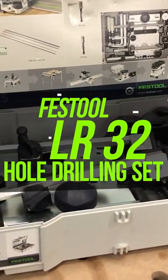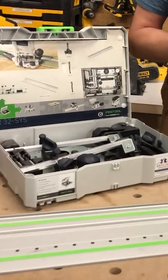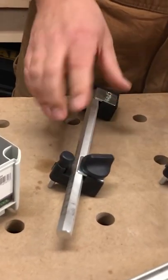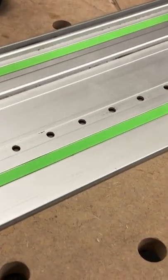This, if you're not familiar, is used for drilling your adjustable holes when you're doing cabinetry. So you get two 5 mil bits as well as a 35 mil bit. These rails essentially attach to your track to sort of preset where you need to be drilling.